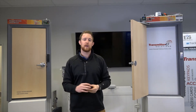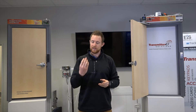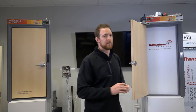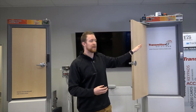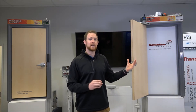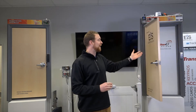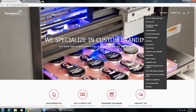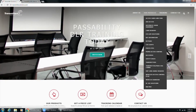The application for this — picture handicap access, or we had an application with an underground parking lot where residents just wanted to walk toward the door and have it unlock. This is the exact application for that. You can have the transmitter in your pocket, wear it on a lanyard, and when you approach the door within range, it triggers and opens. It doesn't have to be on an automatic door opener. You can put it on a gate operator, a man gate, an electric strike, a mag lock — anything will work through the relay.